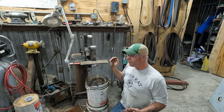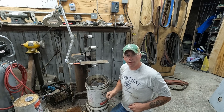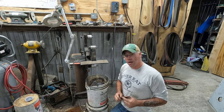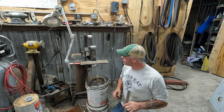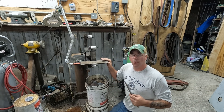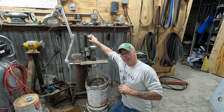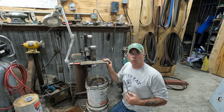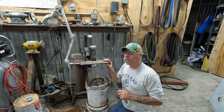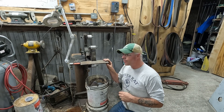As far as the motor, the two-horsepower motor has been perfect for this — it's a 3,500 RPM unit. We have a frequency drive that runs it; it's a three-phase motor with insulation heavy enough to handle it. One thing we're going to lose moving into the next design is the foot pedal I built to take the belts on and off. It works great and I like it, but I'm not going to incorporate that into the new design.